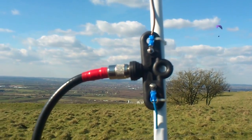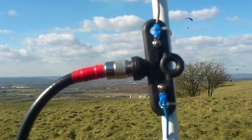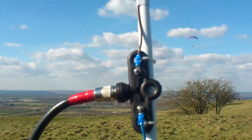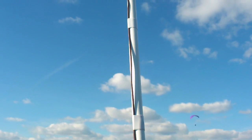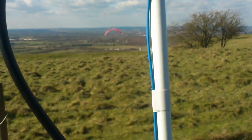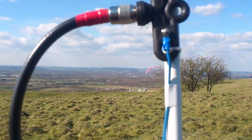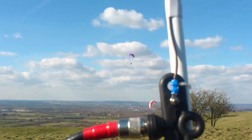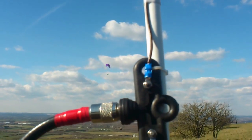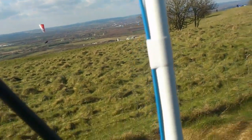There's the connector — that's the RG213. It's all done; a bit more difficult to work with than the RG58, but we got it done last night in the workshop. It's just a simple center-fed dipole, 160 millimeter legs up and down. The outer braid from the coax runs downward and the center runs up, just like you would if you were doing 27 megahertz CB.